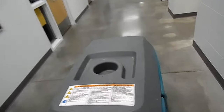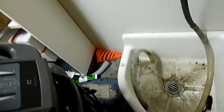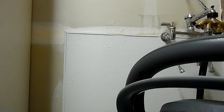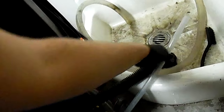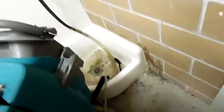Then you'll take it back to the facility, wherever you store it, where there's a drain. You take it, pull it up to the drain, and take the drain hose. You will open the drain hose and let it drain into the drain. Then you're going to want to open this, clean this out of any debris, and throw it into a trash can. You're going to want to pull this out after use and let it drain as well. You don't want anything left in your reserve tank because that'll build up water in the pipes and cause complications.